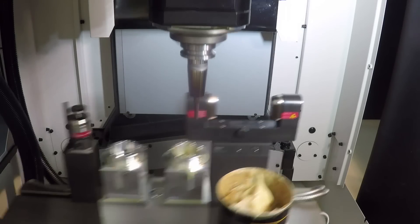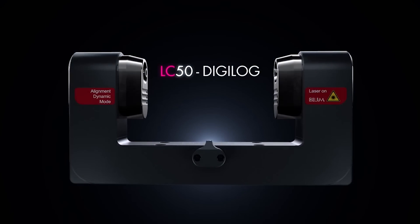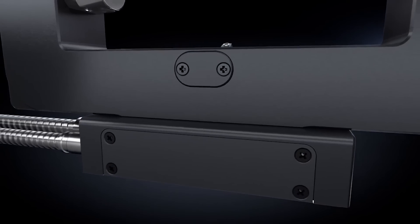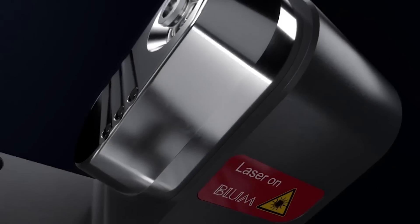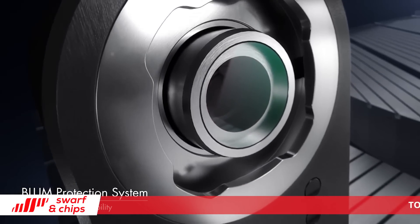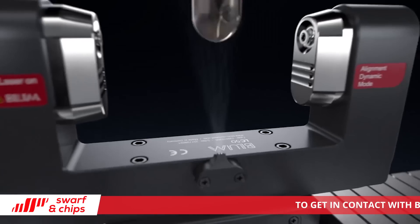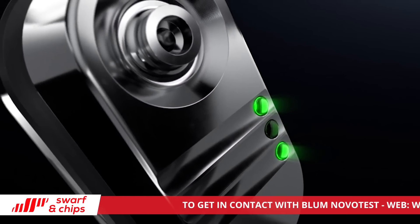On this machine, you're not just checking a ball of a cutter - you can check anything. In fact, you're checking a thread mill. We can check any form of the tool whatsoever. If you're using tactile measurement systems, you literally check the longest and widest part of the tool. But with the laser system, we can scan any part of the tool. And it's not a comparator - you don't need a master. It's actually a measurement. For the laser system with tool measurement, it's truly measuring the tool. We can set length and diameter, and write that data straight to the tool offsets ready for use. We can also give a graphical look at the radial form of the tool to tell you what the shape of the tool is and how it forms.